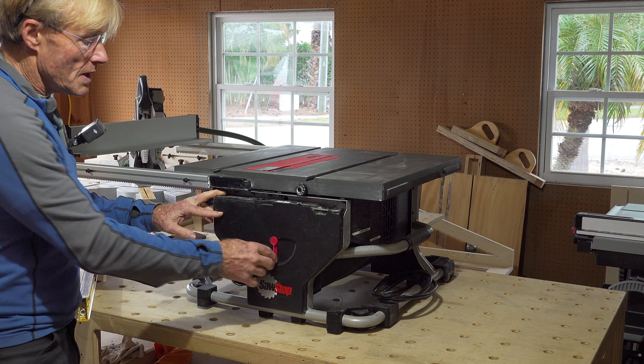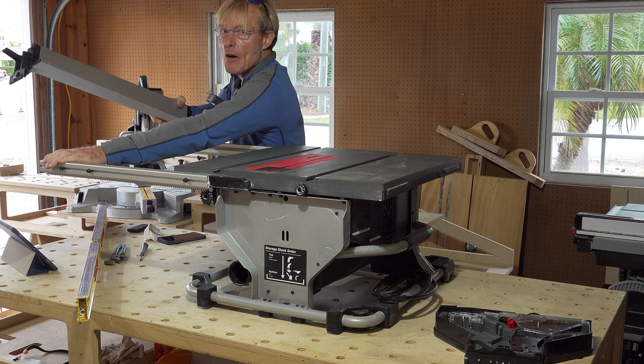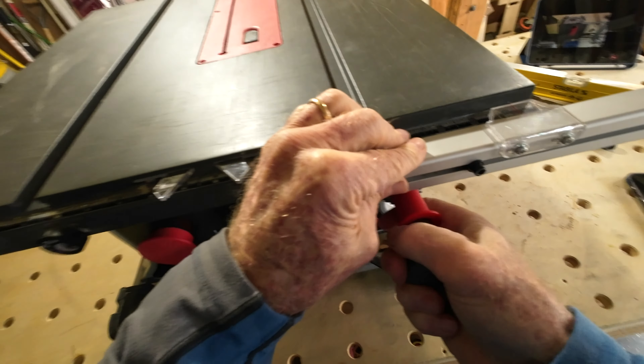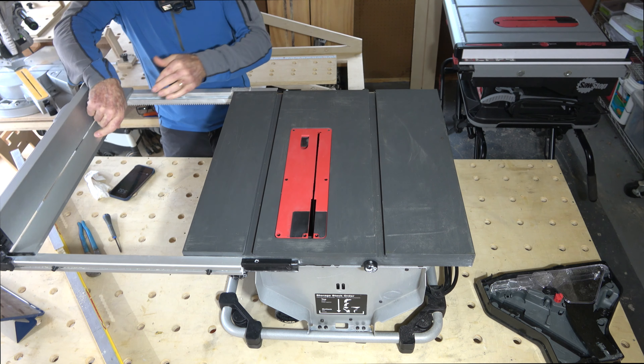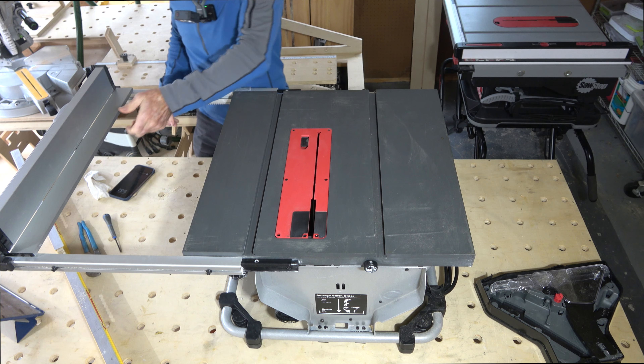To adjust this material support with my CTS, when I push it right up next to the saw and run my fingers across it, it is perfectly adjusted. When I took it out of the box, it was perfectly aligned — I did not need to do this. I actually threw it out of calibration and brought it back into calibration a number of times just to see how difficult it is to do.